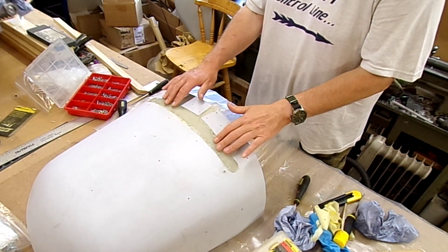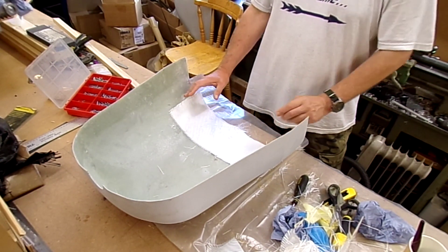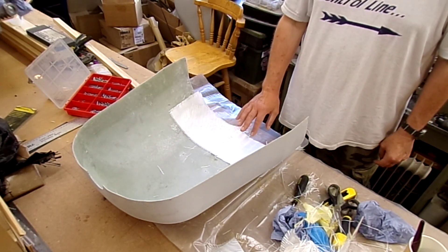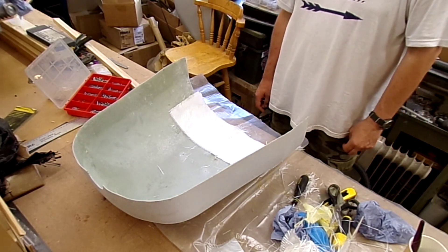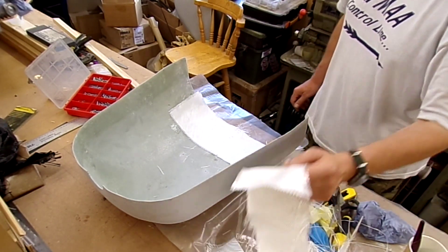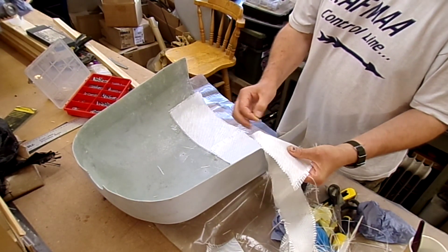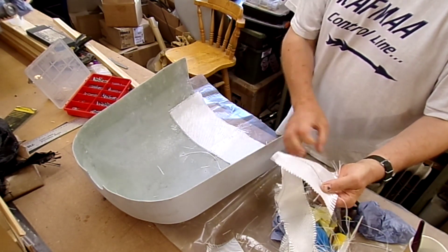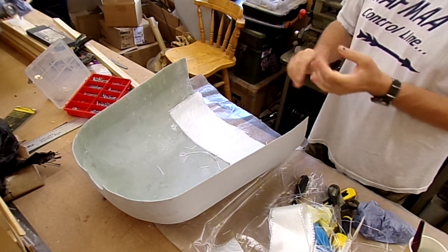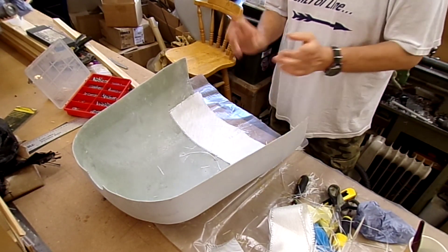Then I can lay in the cloth and we go from there. The plastic is off — there are some slight voids around the edge here but that's minor stuff that can be dealt with with filler. So that's my cloth — I've had to put an overlap joint in as I haven't quite got enough to go the right width at this particular level of cloth. Other areas I'll probably use some of my carbon fiber twill. This is 350 twill — the overlap is about an inch wide. A little tip: when you want to make a rectangular patch you can grab one of the fibers and pull it through, and that gives you a mark so you can get a nice rectangular patch. But if you're going to cut out curves, then you'd actually do that with plastic or peel ply — cut around it, put it in place, and you can trim after it's been wetted out. I'll show you that for the front end.